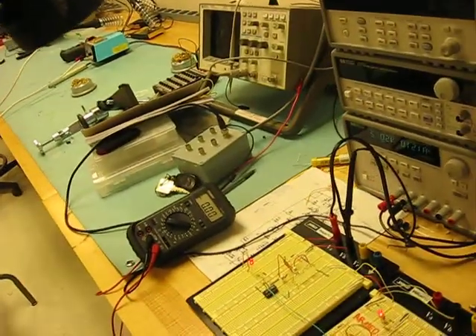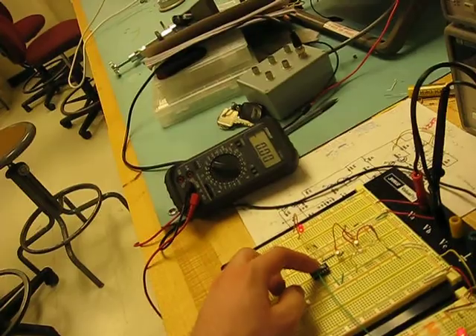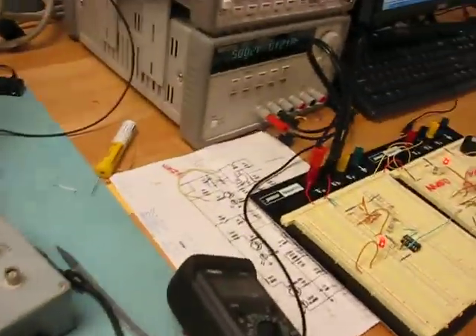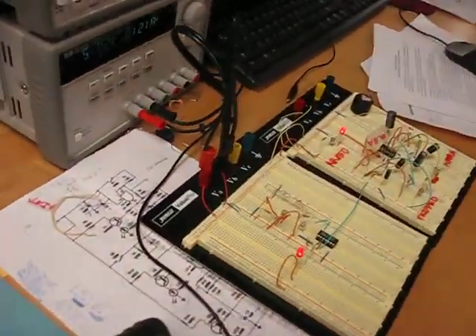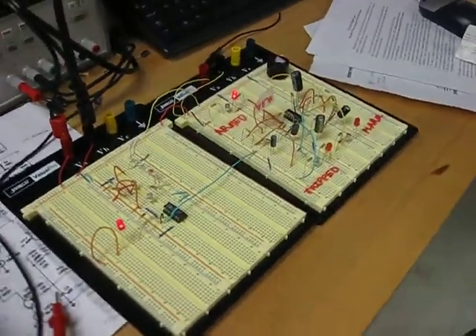To tell you the truth, it might also be because we're not getting a true full five volts from this chip. We're getting — I think it's like four point something. Whenever we block this, let me see if I can measure this. We get 4.2 off of there. So that's something to keep in mind.